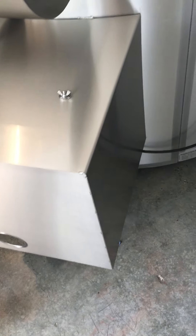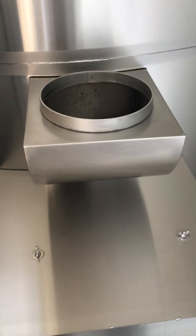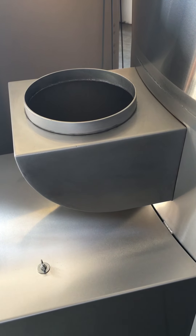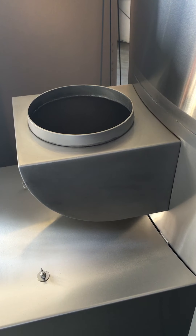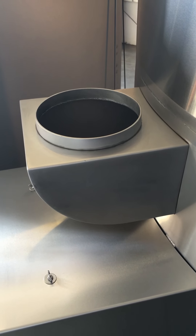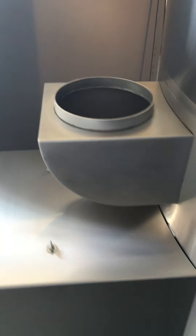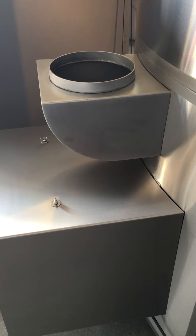The burner exhaust — this box just covers the burner, it's not the burner box itself. That is an 8-inch ID. You're going to want to use a double-walled furnace vent if possible to pipe out of the building. Whatever local code requirement you have is what you're going to want to go by.